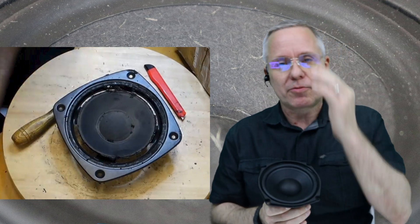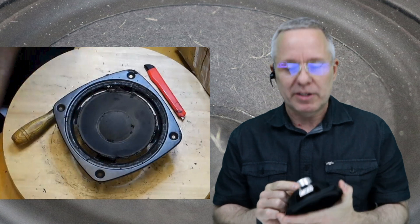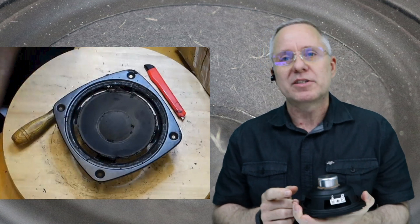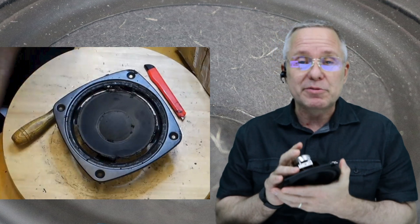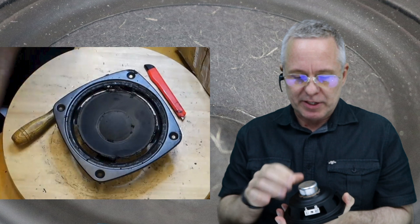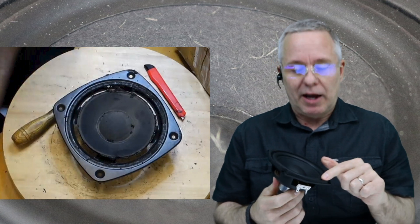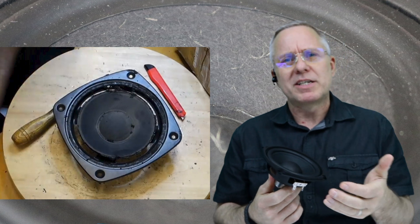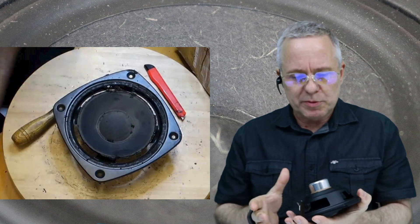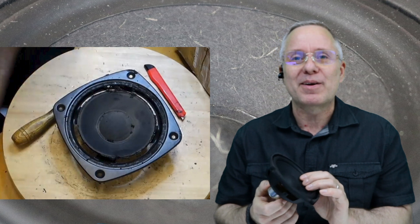That could be categorized by the overall speaker — like an old JBL L100, you might be able to find a repair kit for that specifically. If you can't, try pulling the driver out, and if it's some kind of brand name driver like a CSS or some branded speaker driver, you could find it through that. There are also ways of measuring them and places where you can buy them measured by millimeters — very precise measurements. But the first option is best — somebody has already figured out that a particular model is perfect for it.